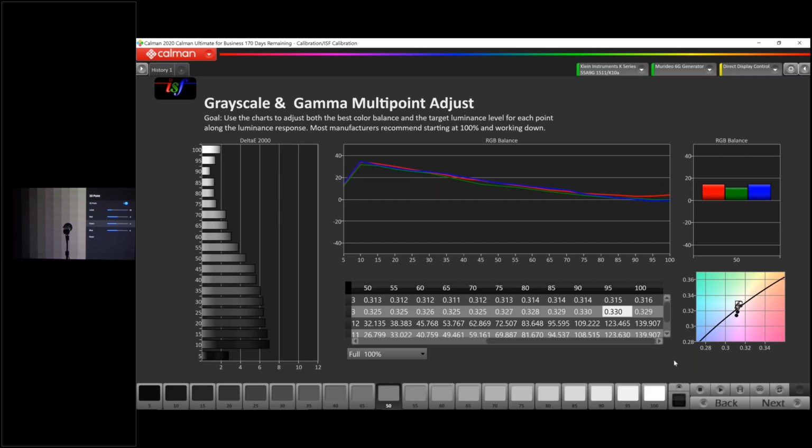There's one other thing I do want to try. We do notice on some TVs, if the contrast control is anywhere other than factory, this doesn't work. Whether 10 point, 20 point, doesn't matter. So let's just test that theory. Let's see if putting the contrast back to the factory position does make improvements here. That does sort of ruin some of the work that we've done already. We might be clipping some white now and stuff like that. But at this point, again, just curious. Let's go back to 50. Now let's see if those controls are a little bit better lined up.